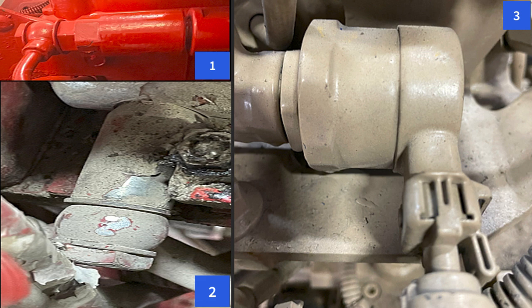If the relief is built into the rail and there's a failure, you have to replace the entire fuel rail. Number three, on the right, is the last type of rail pressure relief valve. It has an electrical plug, and the ECM can actually throttle it open to dump fuel. In my experience, if you have a severe over-pressure that damages it, it has to be replaced. I've seen this on two different engines — some B engines have this relief (number three) and some have the relief in number two. Generally, mid-series engines that make higher rail pressures will have the number three relief with the electrical leads.